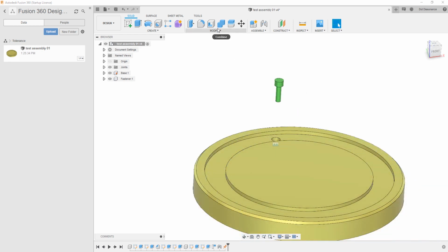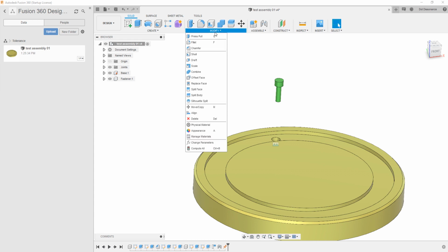For many, many, many years in CATIA, there is an icon called thickness. And here it's offset face. And I thought forever that it was a pretty much useless, maybe old, antiquated icon that had really no purpose, until one day I discovered that instead of thickening a face, because why do you want to thicken a face? If you want to thicken it, why don't you just go back and change the original and fix it, right? Well, I found out that with these commands here, you can do negative values.